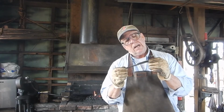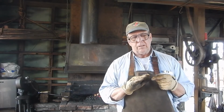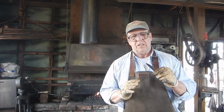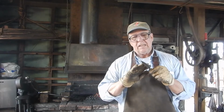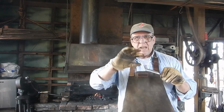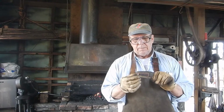No, but anyway, so I'm going to heat it one more time, temper the blade, then when I get home I'm going to polish it with sandpaper. I'll start with about a 330 grit and then go all the way down to 600, possibly 1,000. And when I get down there, once it starts getting the polish, the Damascus waviness effect should start to show up.